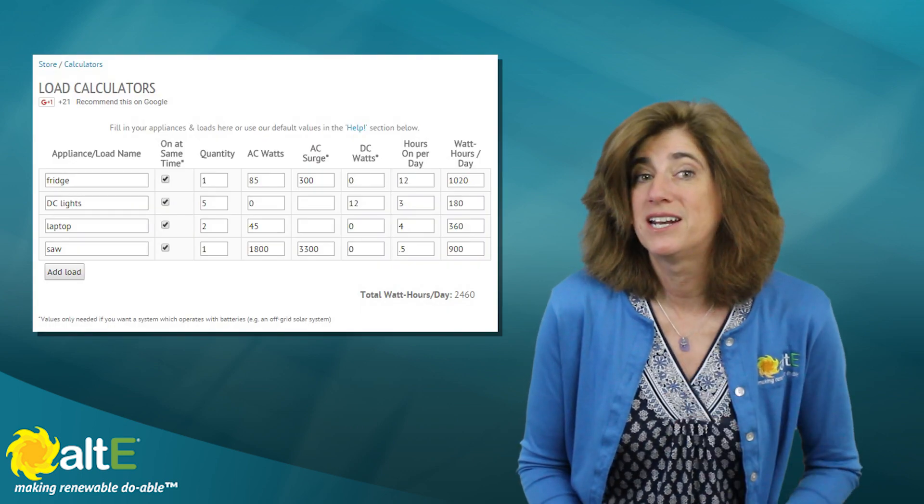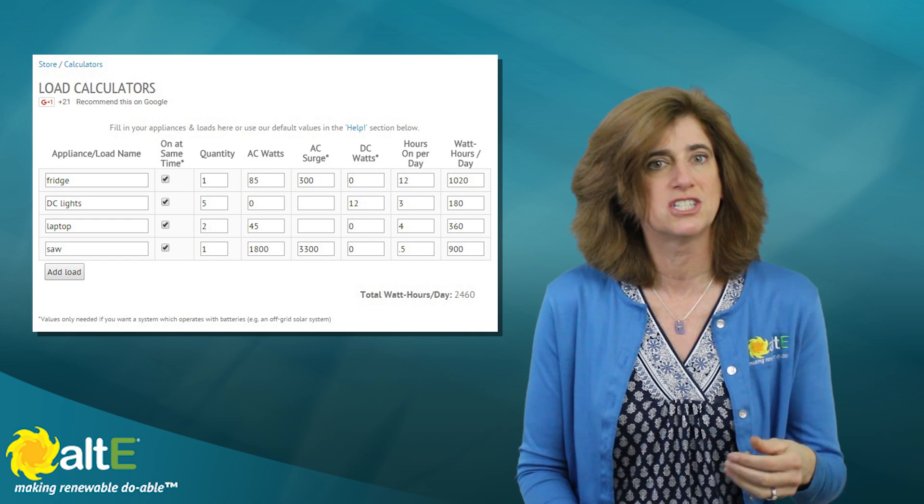You also need to know how many watts total your inverter will need to power. Back in Step 1, you created a loads list that figured out both the constant watts and the surge requirements of your loads. Note that an inverter is designed for a specific battery bank voltage — 12, 24, or 48 volts — and is usually not field selectable. So you need to know your battery bank voltage before settling on an inverter. Keep this in mind if you think you may grow your system in the future: a lower voltage inverter won't work in a new, bigger system, so either plan ahead with a higher voltage or plan on changing out the inverter later.